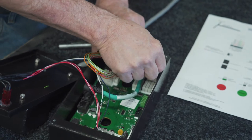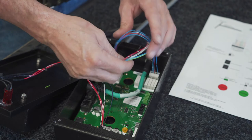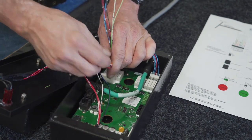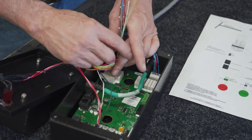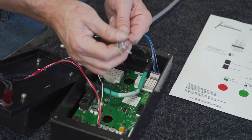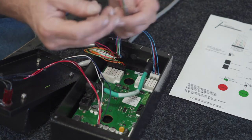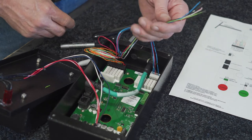Again, once you get these hooked up, go ahead and press them in. Also, when I'm wiring a new tower, I always do the holster controller box first and then wire it up into the tower. On a refurb, the tower will already be wired and coming down. Just make sure that all of your truck power is off. These wires will be active, so any of the hot wires will be carrying 12 volt DC through it, with the possibility of causing a spark or shorting or possibly even burning up the board. So just make sure your truck power's off and you'll be fine with the retrofit.